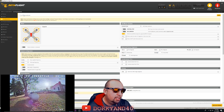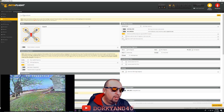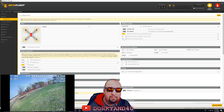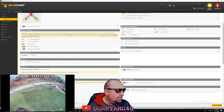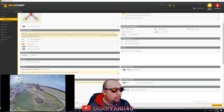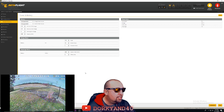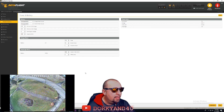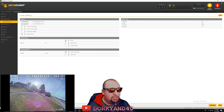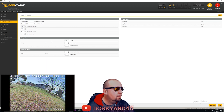There are 12 poles on these motors and bi-directional Dshot is enabled. I'm running a motor idle of 3.5, which seems to work out really well, and CRSF 180-degree arming. On the power and battery configuration, I didn't copy over the scaling — I definitely recommend you do that and check your voltages to make sure you're not going to be killing your batteries.